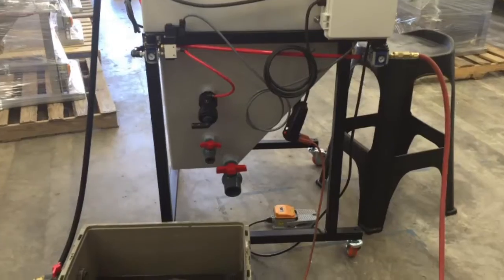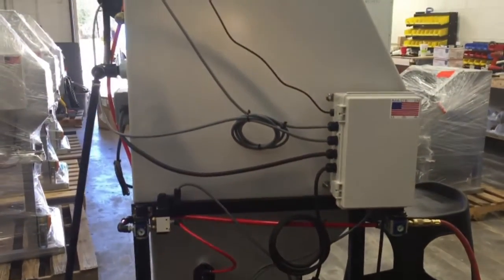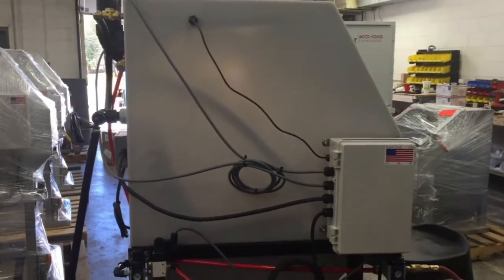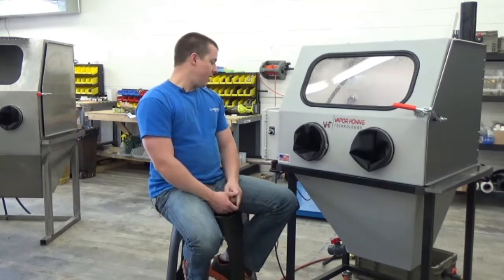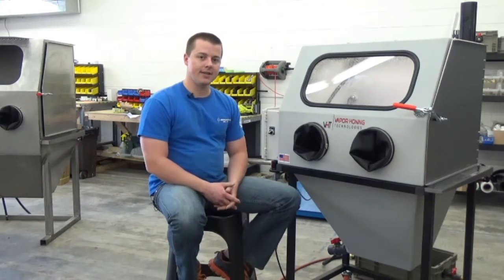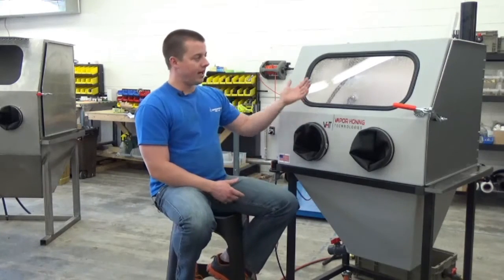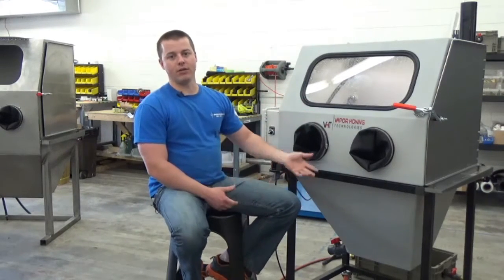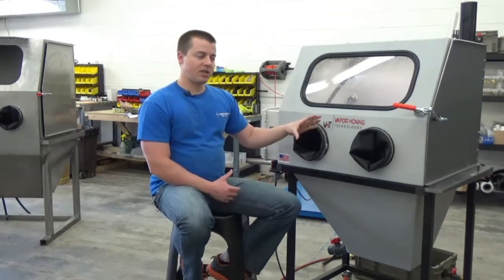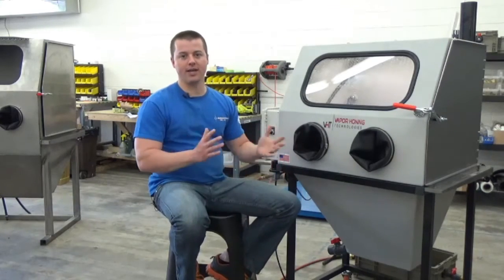There are three valves on the side. You have an inch-and-a-half valve on the bottom for main discharge — when you clean the machine out you take the old spent abrasive out and put fresh in. Above that is a valve to drain the water off the machine: if your abrasive is still good but your water is contaminated, just use that valve to dump the water off, keeping your abrasive in the machine so you can refill with fresh water. The top valve on the hopper is what we call an overflow valve, which eliminates excess water rise in the machine. As you add fresh water for window rinse and from the rinse-down gun, the level rises, and at a specified point this valve equalizes it back to where it needs to be.